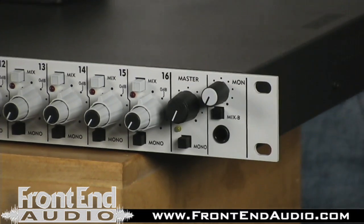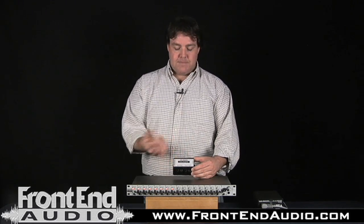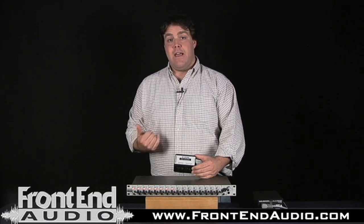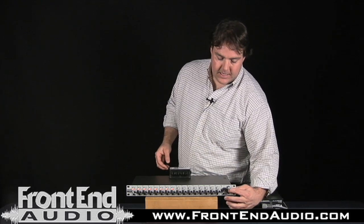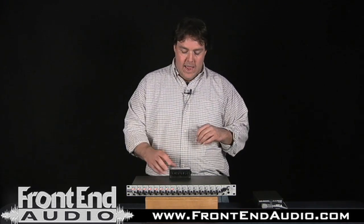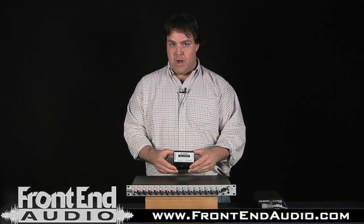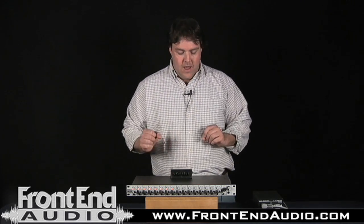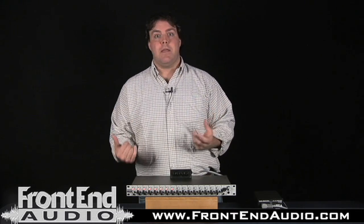Mix B on the outputs here is going to be pre-fader. So on this box, with this out, this is now going to be purely a pre-fader output box. With mix B now selected, mix B is feeding the headphone output, and now this is controlling the output on the mix B on the breakout. So a lot of dual functioning going on here. It seems confusing, but all of it does make sense when you really think about the practical application of use.